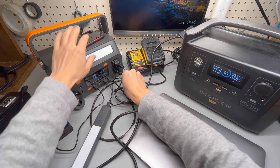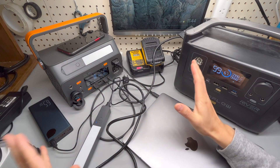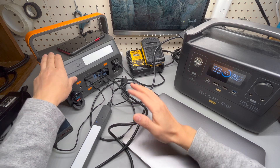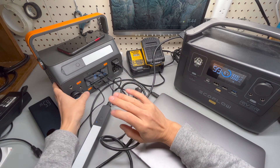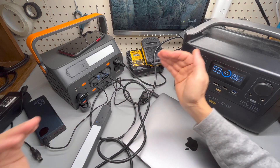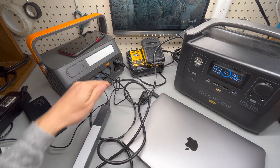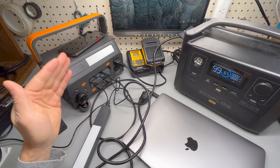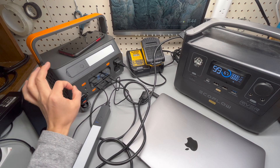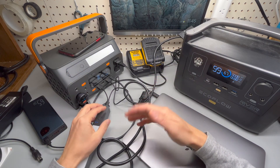It's cut off again, so you have to disconnect the high load. No fuse to replace — that's the beauty of this thing. The protection is done a great job. It has this cut-off built in, and you don't have to worry about damaging the device if you accidentally plug in something you shouldn't. Keep the load under 300 watts, and it can handle 600 watts peak according to the user manual.